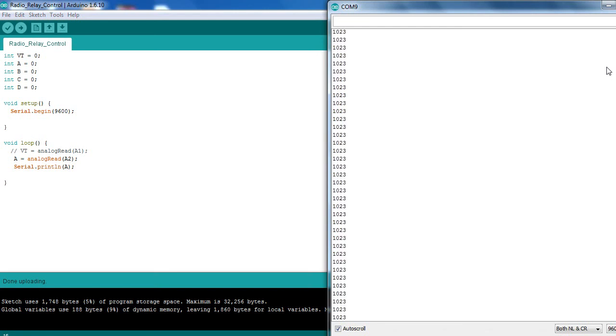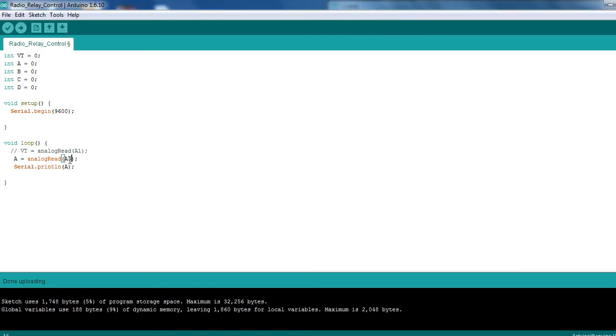So that's actually showing on C. I would have thought it would have been the first one, but it isn't. So what I'm going to do now is change the analog read from 2 to 3, and then re-upload the code.